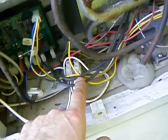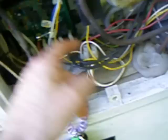And the reason why is just because of the sheer magnitude — at the 20 megaohm range, the current that would flow would be in the microamp range. Next, I measured the resistance between the two heater leads, off the circuit board. The factory spec says 44 ohms plus or minus 10%, meaning the resistance can be as low as 39.6 ohms and still be within spec. I got 38 ohms. The difference of 1.4 ohms should not be enough to cause that fuse to blow — but who knows.